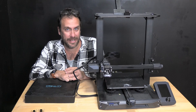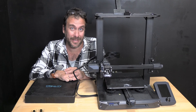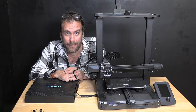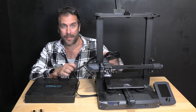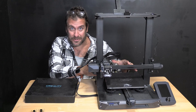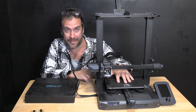However, the main argument to switch your magnetic bed to glass is to resolve your bed leveling issues. By placing glass on top of the plate, it'll rectify any potential inconsistencies with the level of the actual plate the magnetic bed is sitting on. By placing a flat piece of glass over it, you're doing away with all those issues that may present themselves by having such a thin magnetic bed sitting directly on top of that plate.